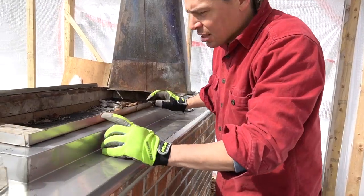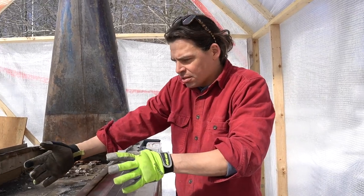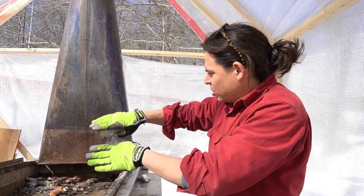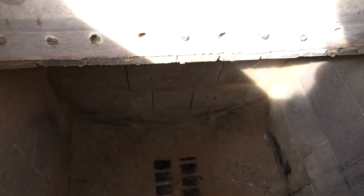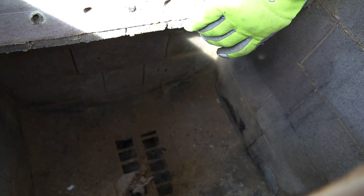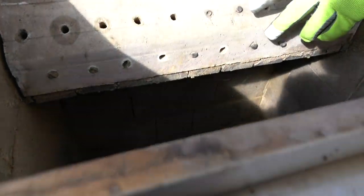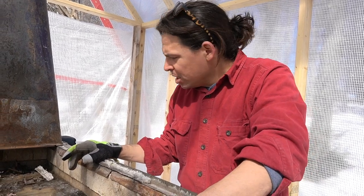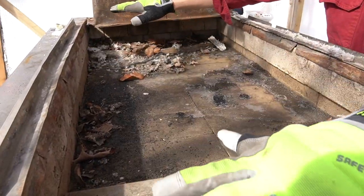This is the inside of my arch. It is atypical — most arches have a firebox down below, and then at the back of the firebox the brick slopes backward. This firebox is about 18 inches deep and it slopes forward, not very far, about six and a half inches. On top of that slope I have this manifold that I made out of cast refractory concrete — high temperature concrete — and the secondary combustion air gets drawn up through the bottom of this section, with the pans sitting on top.